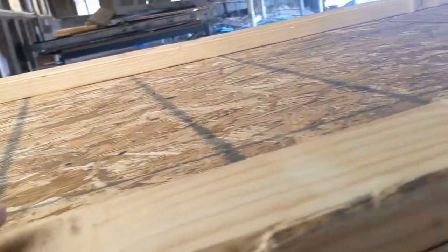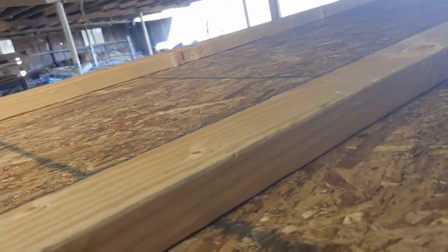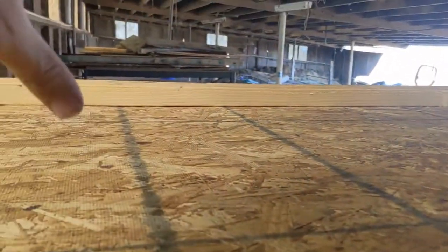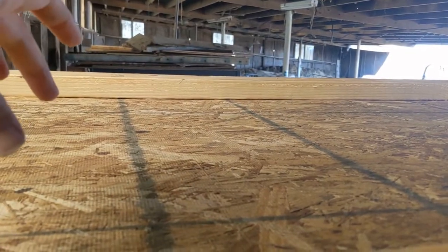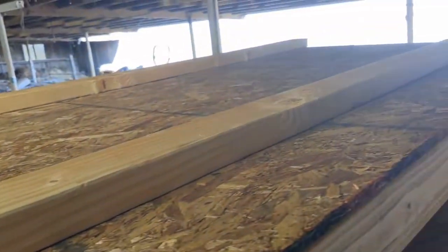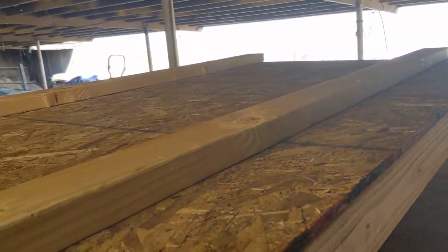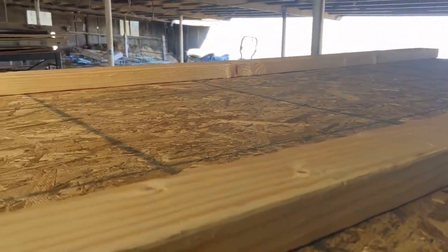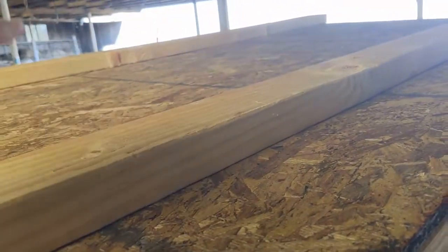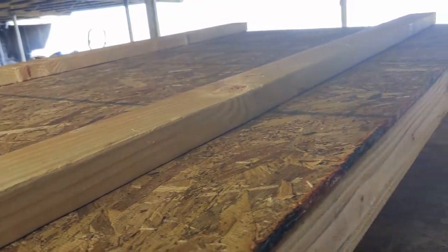Here's the top. I put two supports side by side, because I'm going to be putting big sheets of plywood and stuff up here. I didn't want one vertical support in the middle, because that would make it really awkward to store plywood. So I put two running parallel like this — nice and flat, low profile — so when I put OSB or plywood on here, it's got a nice flat surface to rest on.